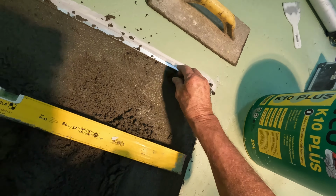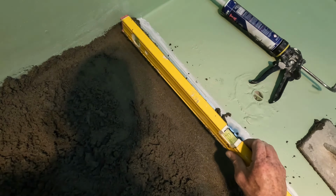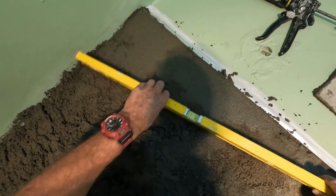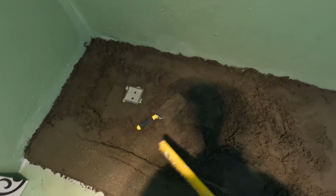See, there's a little bit of aluminium showing there, and it's quite flush there. Well, that floor or the aluminium is slightly out of level. It's good. What you don't do is level there, level across, and then level down there. You will never be right, or it's pretty hard to get it right. You always go across there and then join them up. The chances of you being correct is a lot better.